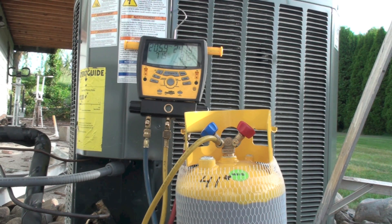What we're going to do now is recover this air conditioner. The first thing I want to show you is how to do this without recovering liquid through a recovery machine. I've told you in past videos I'm not real interested in recovering liquid that way — I've had a lot of machines damaged because of it.